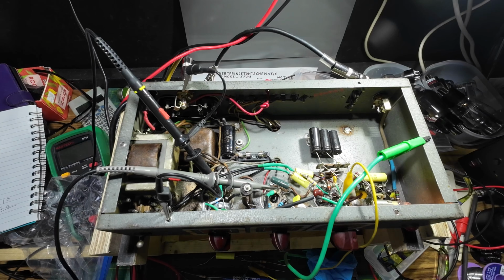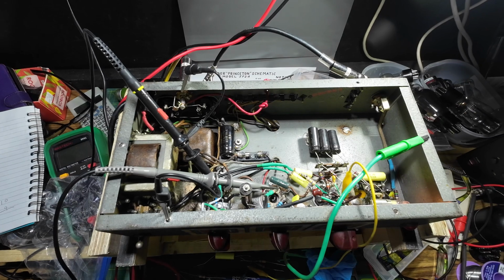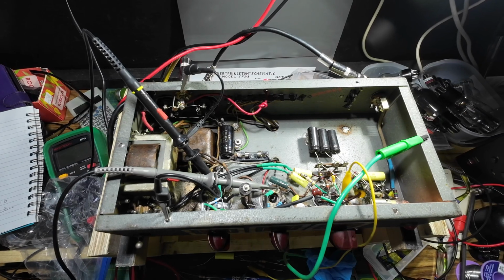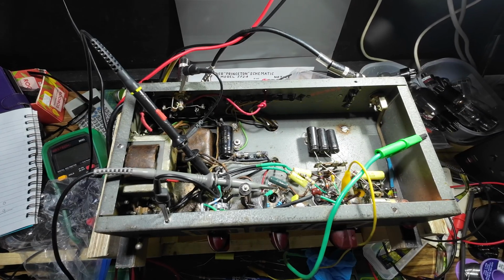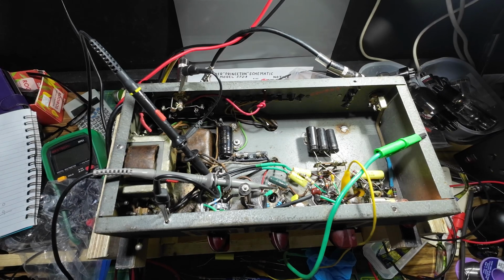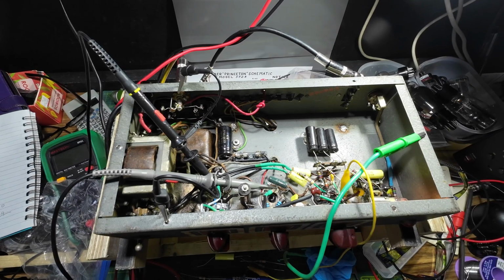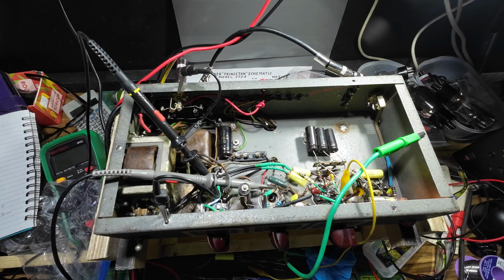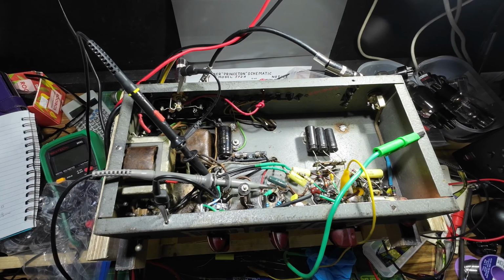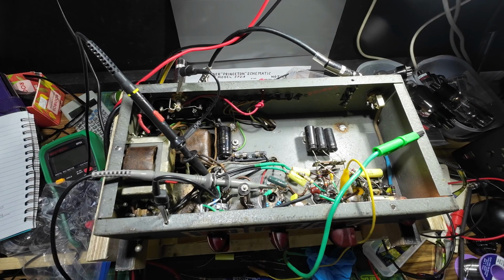So be very careful when you're swapping and wrapping these tubes, these rectifier tubes, because you could end up burning out the power transformer on a gig. And that's why we test, because when things have been changed like that, it's always best to test and make sure that that's going to be okay, and it's not. So only a 5Y3 for this amp, without a doubt.